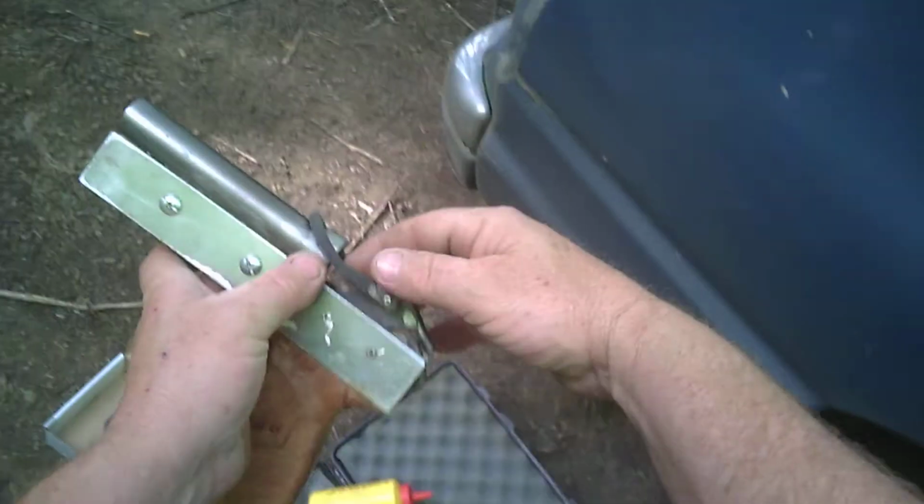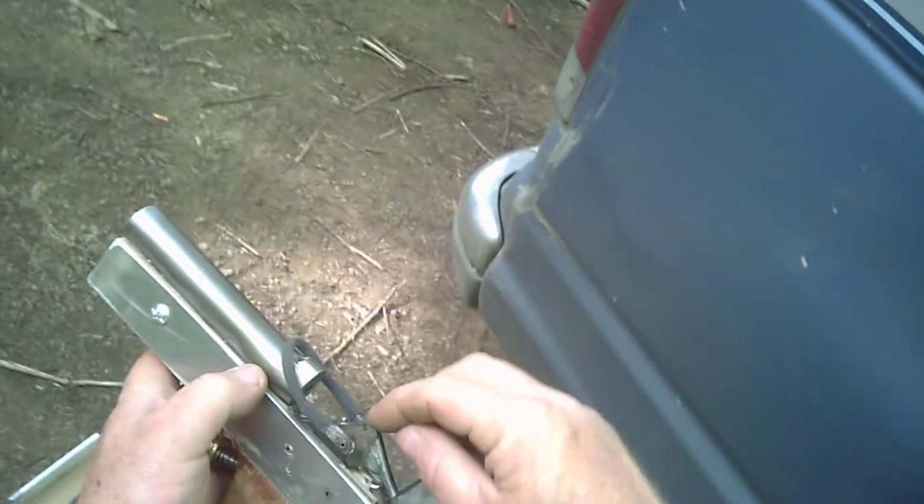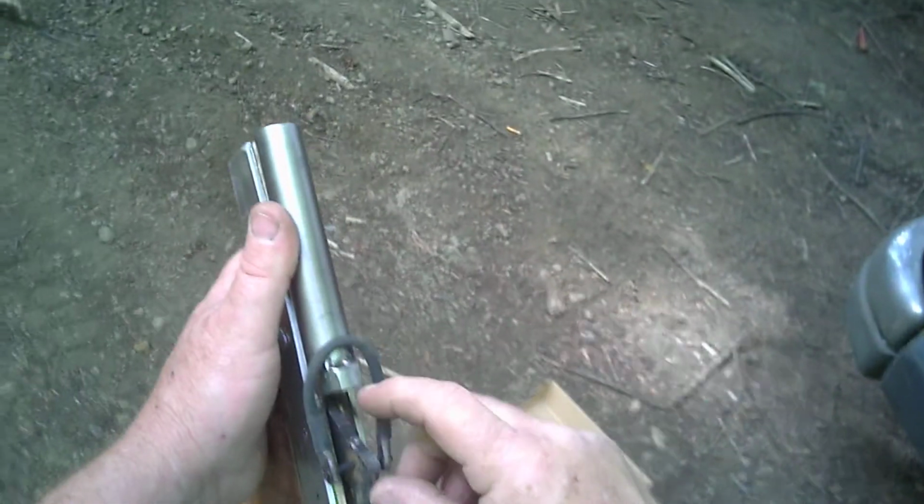So, this is just aluminum scrap, and these bolts, I don't know what they call them, but they're a male and female, and I had to trim them and thread them a little bit in order to make them suck in tight. And then the way this is retained, this is actually 1/4 inch rod, just like these pieces are. The hammer actually has a piece of 1/4 inch rod welded to it, and then I formed it onto a piece of flat stock. I had to grind and file to get my primer, my firing pin. But these pieces are 1/4 inch flat rod.